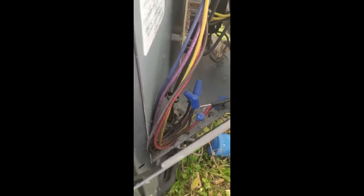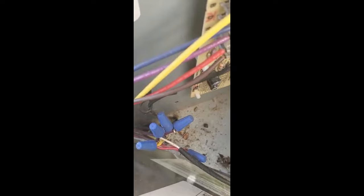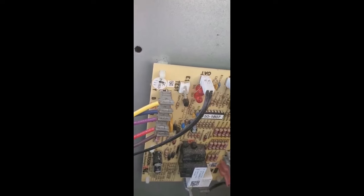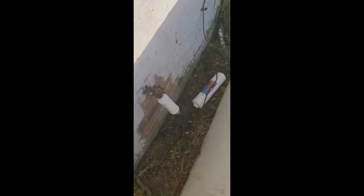Where I've got the wires connected: the red wire is connected to the yellow, which also has a small yellow wire to it; the white wire is connected to the brown, which has a small blue wire. Those are coming from the electrical here — so what we're looking at is yellow and brown, basically the top and bottom, Y and B. Do a little research because every system is going to be a little bit different, but generally it's going to be those two.